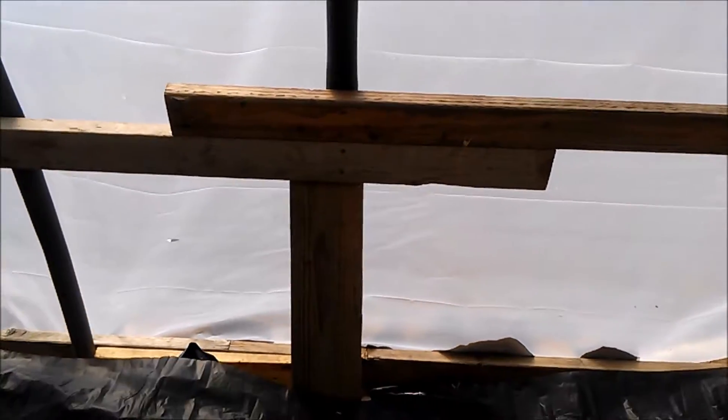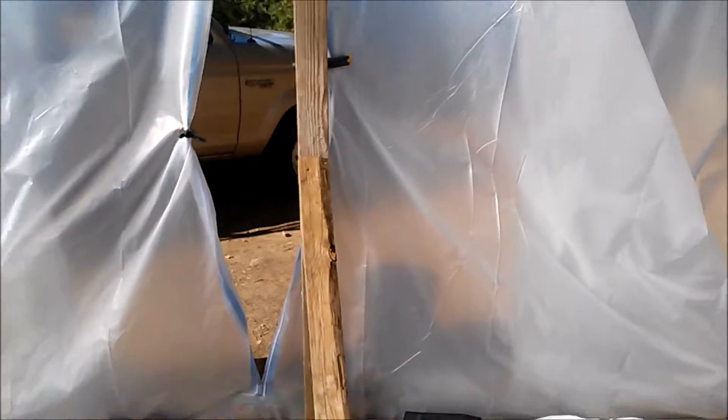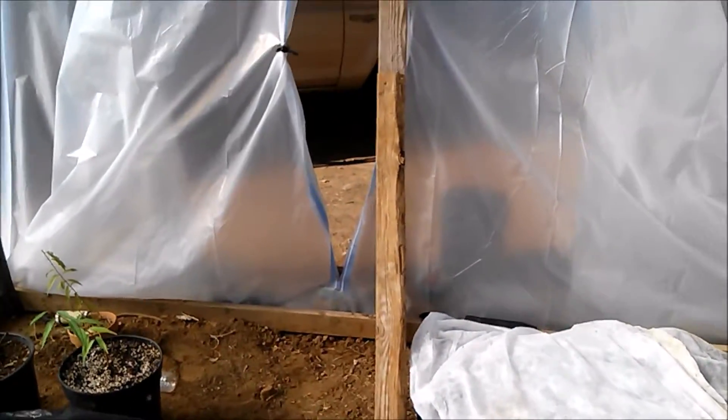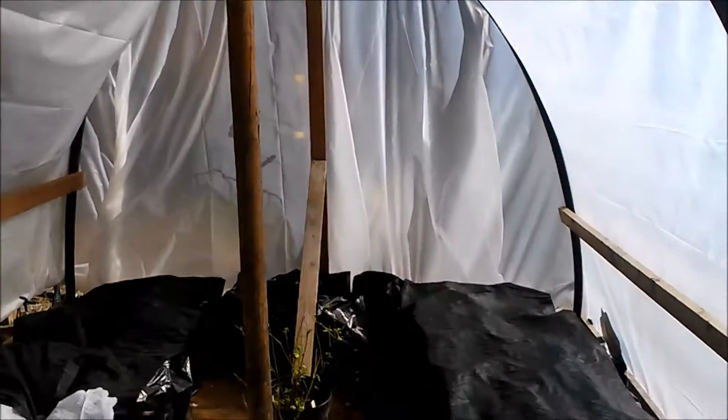For my purlins, I got two-by-four and got it screwed in there. On the outside I screwed it in from the front side, so it pulled these down in here a lot more. That's solid. For my braces I put a short two-by-six on the front wall — pretty simple, keeps it from going side to side. On the two end walls I have two-by-four on each side.